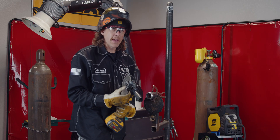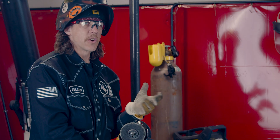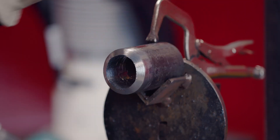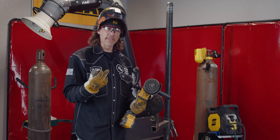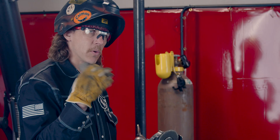What I'm looking out for is to make sure that I'm not getting too far off to one side or the other — basically making sure I'm not getting a taper — so that my wall thickness is the same all the way around. The burr bit is really aggressive and it leaves a lot of lines and marks, so this cone here is going to help me smooth all that out.